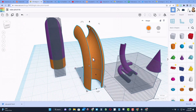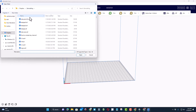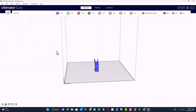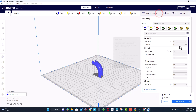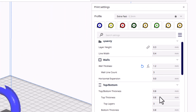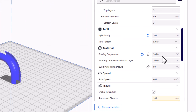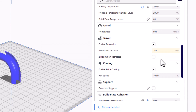I'm going to print this on my A10T. Here's my A10T in Cura — let's grab that part. I'm in my 3D modeling folder and there is 'tube pinch fix.' It automatically slices because I chose that in the settings: 16 minutes. It's going to print via USB. I'm doing 0.3 layers, 1.2 walls, 0.8 top/bottom, 30% infill, 205 and 60 for temperatures, print speed 60.